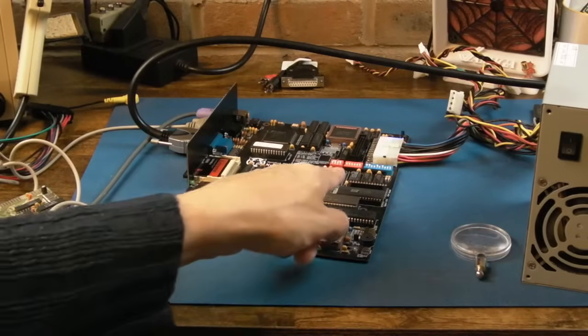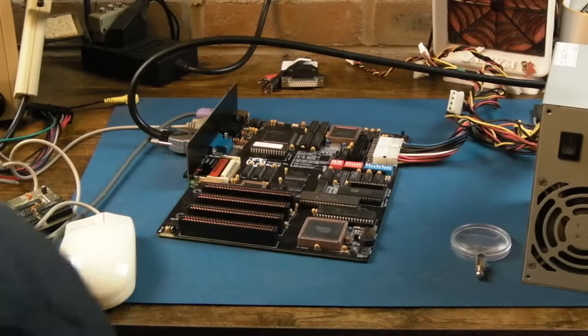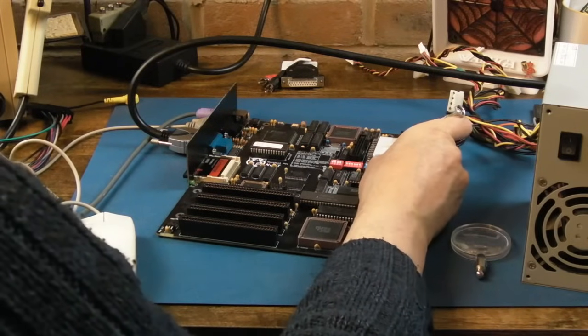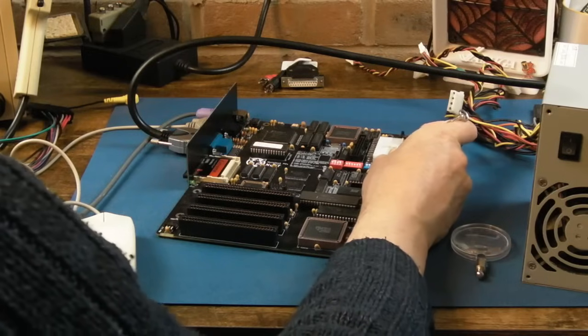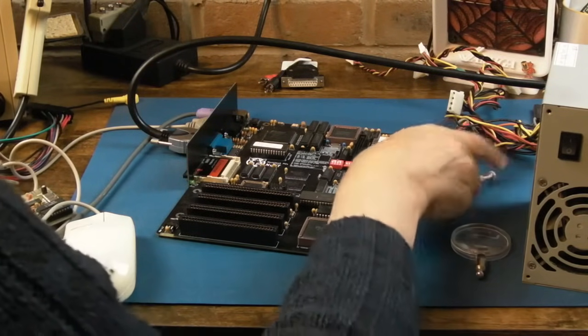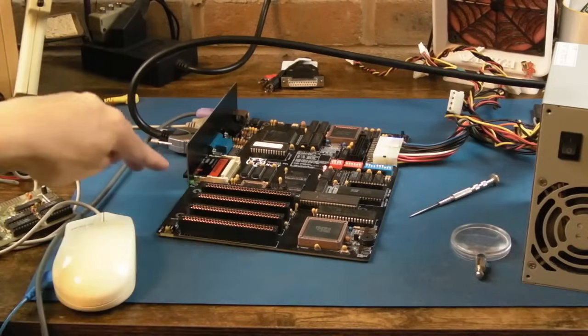But there was, when the dip switches were set crazy. Oh, bear in mind, hang on, let's switch it off again. Bear in mind, the way it's set at the moment, dip switch 6 disables the XT IDE. Let's just flip that up and down a few times. It feels really spongy. I'm not even sure if that's working, to be honest. Let's try that. No, it just says booting OS and then does nothing.